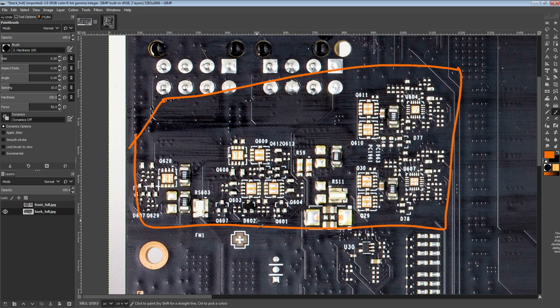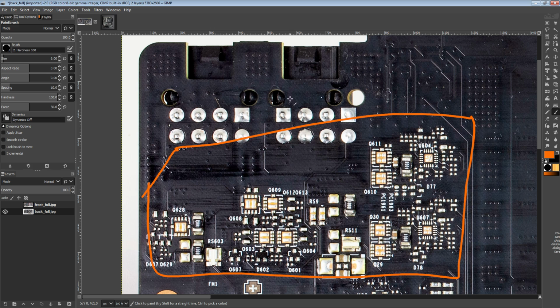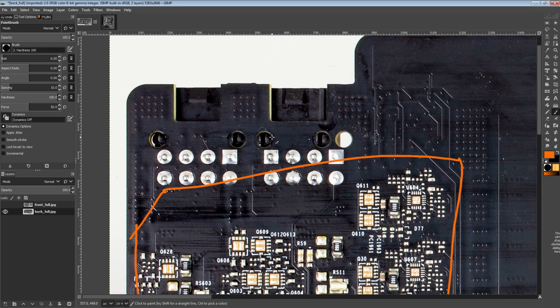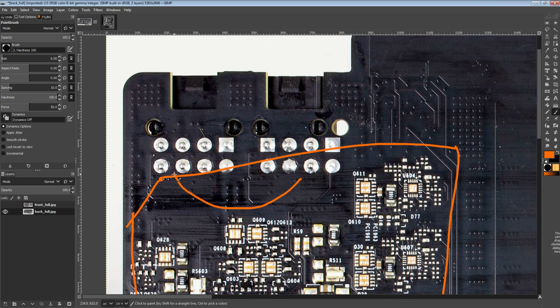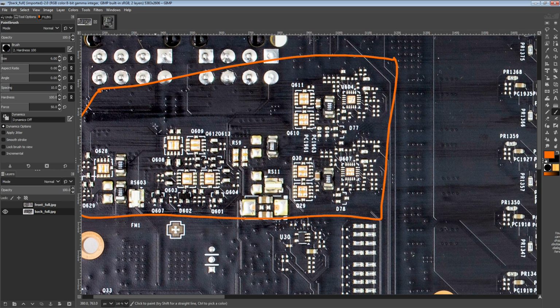here we can actually notice that we have no current balancing circuitry, as you can clearly see. I'm not sure when exactly NVIDIA started doing all the current balancing stuff, but basically on modern NVIDIA cards, normally you have a whole bunch of MOSFETs for switching where 12 volts comes from and where it goes. And the idea behind this is that if you pull too much power from, say, the 6 pin and bounce off the power limit of the card in software, it'll basically reconnect a phase or maybe 2 phases from the VRM to the 8 pin so that you stop bouncing off the 6 pin's power limit.